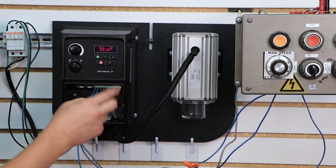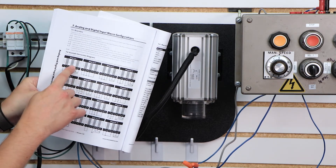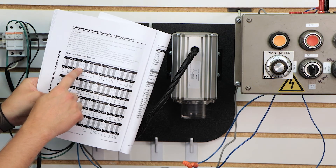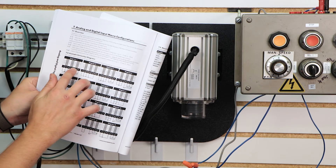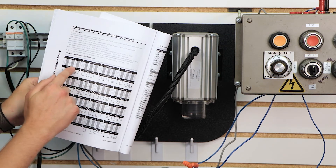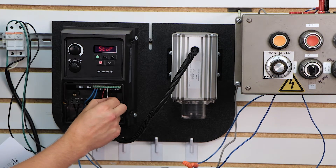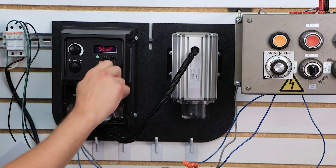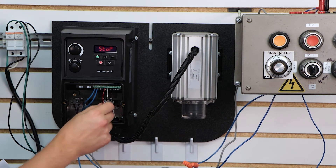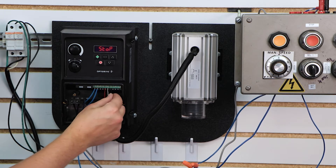The second step is to actually give it a speed — this is where my speed potentiometer comes into play. Looking at the diagram, there are three different connections: a plus 10 volts DC, analog input 1 which is my actual speed reference, and 0 volts or my common. Any speed pot you purchase is going to have a three-wire setup, and you need to look at your speed pot to find out which terminals correspond to which voltage. In my example, my red wire is my plus 10 volts, my black wire is my common, and my white wire is my speed reference. As I turn the speed pot, voltage goes through the potentiometer — which has a resistor in it — allowing 0 to 10 volts depending on where the pot is to flow into terminal 6. Terminal 7 is simply my common.